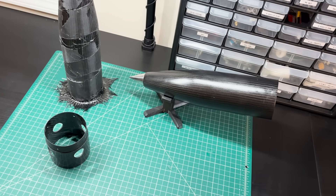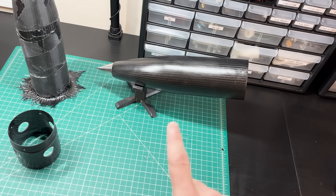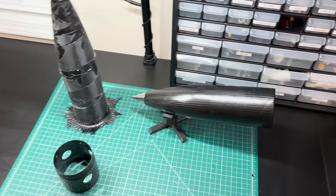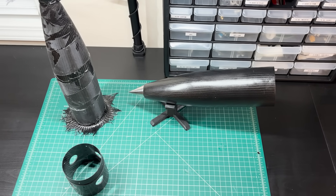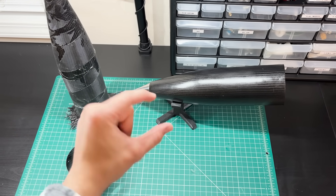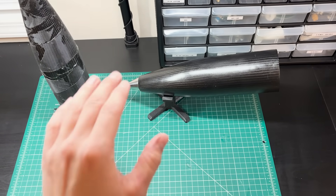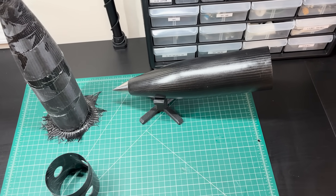Composites as a class have a number of unique characteristics. First, they generally have really strange or unique manufacturing techniques that let you make really complex parts like this nose cone surprisingly easily. Second, they have really good strength-to-weight ratios, which is why you see composites all the time in aerospace or high-performance applications like Formula One. Third, composite materials are usually non-isotropic — meaning a cube of carbon fiber's strength depends on which side you push on, letting engineers apply strength in the directions that matter most to reduce overall weight.